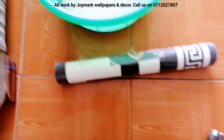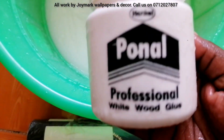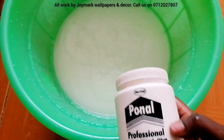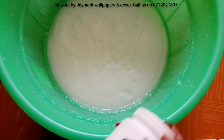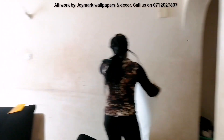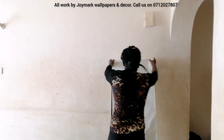This is the wallpaper being installed — this was actually the client's choice, not mine. I normally add Pona, which is a wood glue. It helps ensure that the wallpapers hold longer, and also helps on the edges where everyone is passing so you don't want the wallpaper to keep coming off.